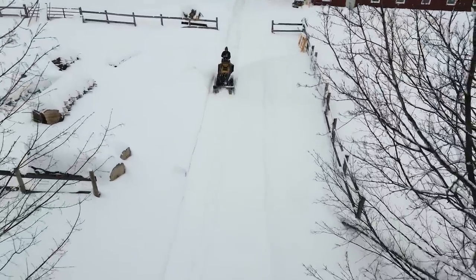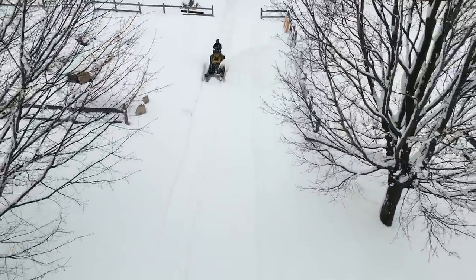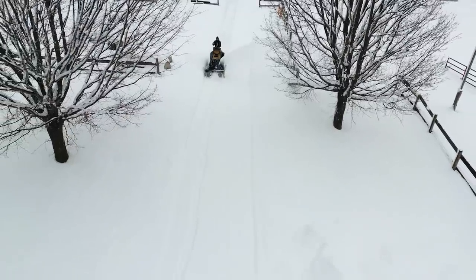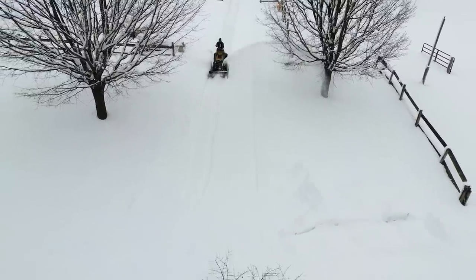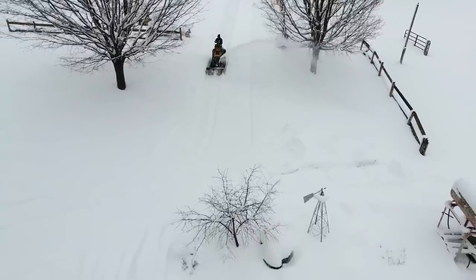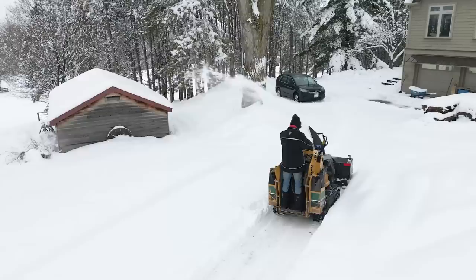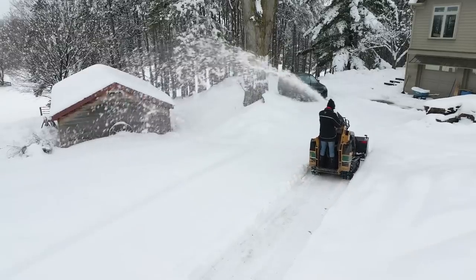So the bathroom is one of those things that is on the list of things that can be added at pretty much any time. We talked about this as we were going through the build, and I could have had the plumbing installed into the floor for a bathroom, but that does limit me to putting that bathroom exactly where I think it should be today, having never used the space at all. So we opted to omit the plumbing completely in favor of doing something in the future and putting the bathroom anywhere. The only downside to that is that the bathroom floor cannot be directly on the concrete floor.